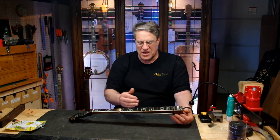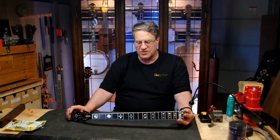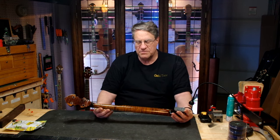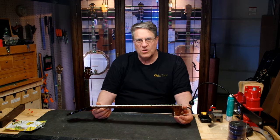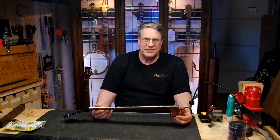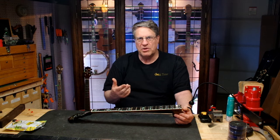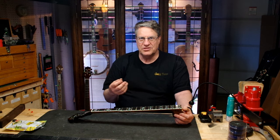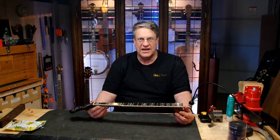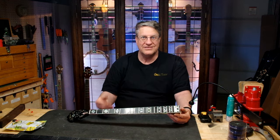The rod needs enough flexibility that it can move back and forth a little to operate properly. If it were an epoxy, that would glue it in permanently as a solid object — so that's out of the question. It also needs to be something that won't stick to the rod. Silicone comes to mind, but it's not exposed to the air, so it needs to dry without air exposure. So instead of a chemical polymerized cure like epoxy — which is too hard — I'm thinking of a thermal hardening: something put in hot while melted, then it cools down and solidifies, but not too much.